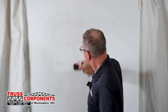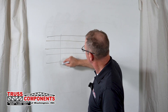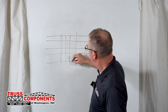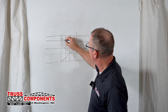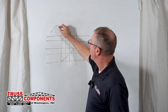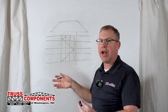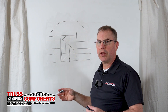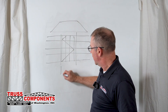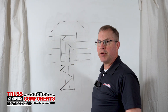Looking from above, you would have a set of trusses that are the full span on the bottom with a flat top, and then that piggyback brace frame would be trusses that have studs at two foot on center with the necessary diagonal bracing built into them. It's a quick, easy, safe way to get those purlins up on top of that tall base truss. Rather than bringing individual purlins and diagonal braces up separately, the piggyback brace frame is just one piece the framer can put in place very quickly and safely.